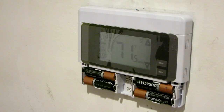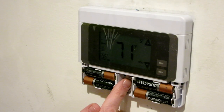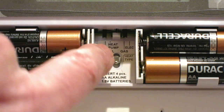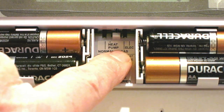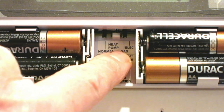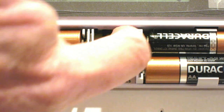There's one more thing to check, and that's the HVAC type switch down here. The instructions say to set it to the normal position if you have conventional natural gas, propane, oil, or electric heat — and as you can see, it's set to normal. Over here it's a little more confusing: you have two choices, gas and electric. I have oil, but it turns out according to the instructions you should have that set to gas — so that's how it's set.